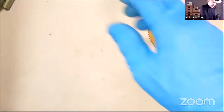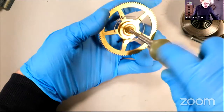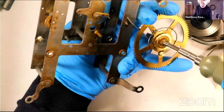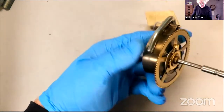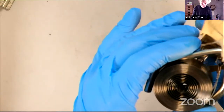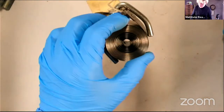And then somewhere I've got the spring, death trap spring. So this clock winds to the center. Which train this is, let's just have a look at this movement. So that goes that way around. So this is the going train. Yeah, I've put the right label on the right thing. So let's just figure this out. Winding counterclockwise, winding counterclockwise. Goes in there like that. Middle of the spring. Might want closing up a bit just so it hooks on. I don't want to get the clock together and it not hook on. Yeah, I might just do that now before I forget. Maybe it'll be okay.